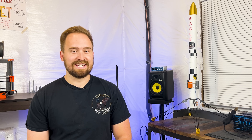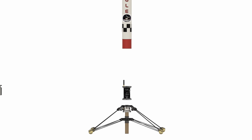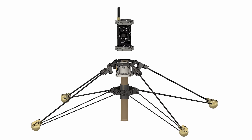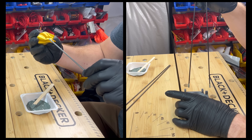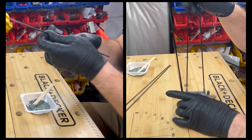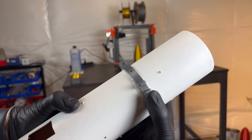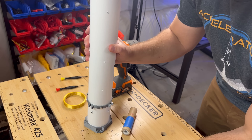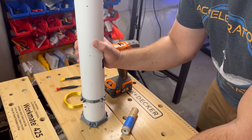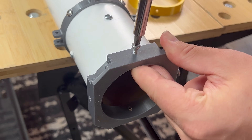The plan was to build it like a tank because I anticipated probably a couple failures along the way. All the necessary components for the legs were first drawn out in CAD. To give the rocket a good chance of landing I gave the legs a low and wide profile. The applicable pieces were then 3D printed and later epoxied to the carbon fiber struts that were pre-cut based on the CAD drawing. To ensure that the legs were mounted to the frame with maximum strength the top ring was epoxied and screwed in place. The bottom ring had an inner slot that allowed the tube to slide into place and be secured from both sides and the bottom, so that if the rocket hit the ground hard the screws wouldn't rip through the tube causing structural damage.